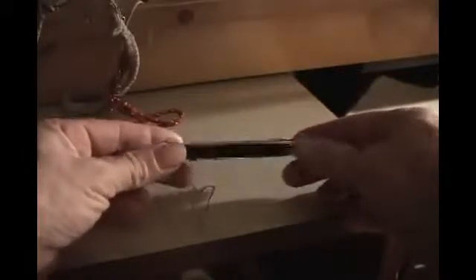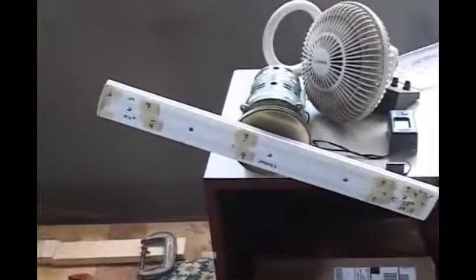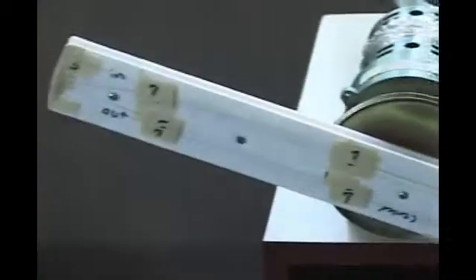One primary question was how many turns of wire to use on a coil. Guitar pickups run around 5,000 turns, though they run as high as 10,000. So I built the step coil. I wound an 18-inch coil, pulling out a loop every 1,000 turns, labeling it and taping it to the outside, continuing up to 10,000 turns. I would be able to make a dedicated test pickup where, using jumpers, I'd be able to step from 1,000 winds to 10,000 winds and find the optimal range.